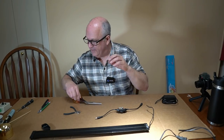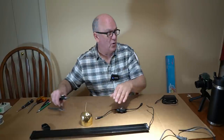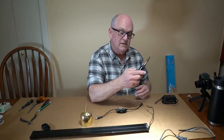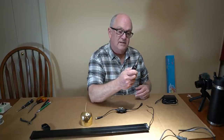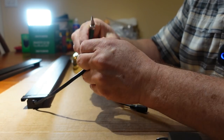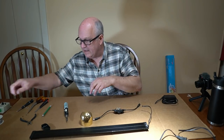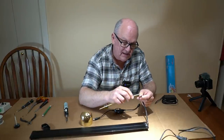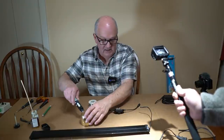Spectacles, so I may see. I'm using a cordless soldering iron. While that's warming up, I'm going to take and strip the ends of this wire just a little bit. I believe the official word for the next step I'm going to do is called tinning — taking a little bit of flux and some solder.